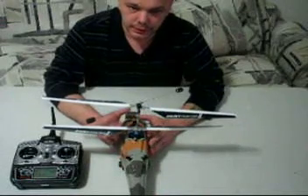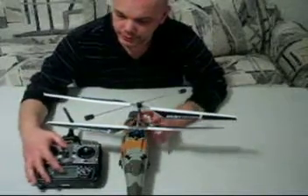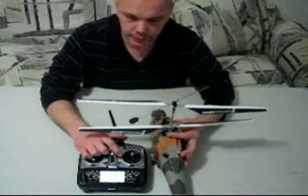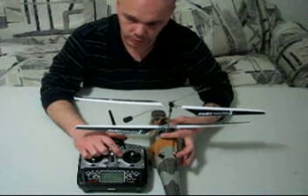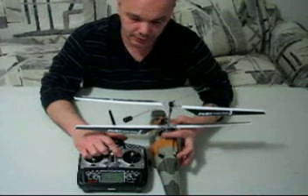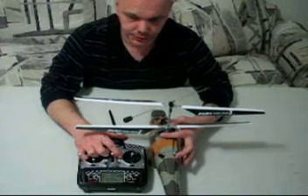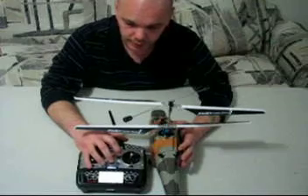So again: if the elevator trim is set full forward, the elevator push rod needs to be lengthened — you screw it out one or half a turn at a time, depending on how bad it's out of alignment. If it's full up, you could probably unscrew it a turn or two, put it back on, level everything out again, and bring everything back to 50%.